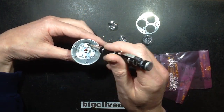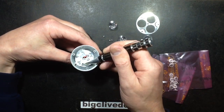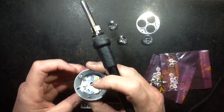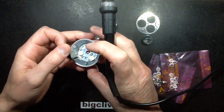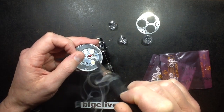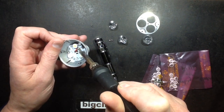So here's the LED circuit board in there as standard, and it's stuck in with the standard silicon heatsink compound, but it's not glued. So initially I'm going to desolder these leads. I'm going to actually touch them with a bit of lead-based solder just to make it flow better, because it looks like that dry, crusty, lead-free stuff. And rather fortuitously, red is actually positive, which is quite nice. So I'm just going to lift those wires off.